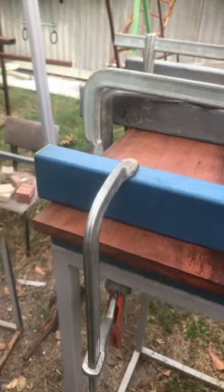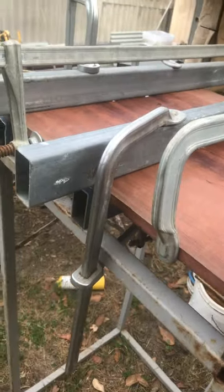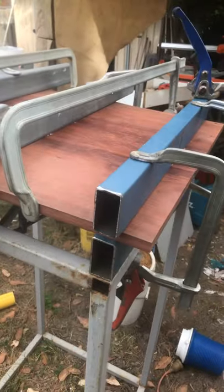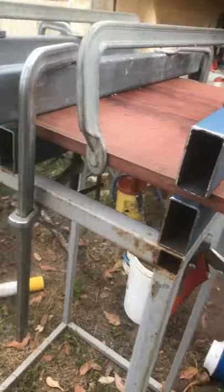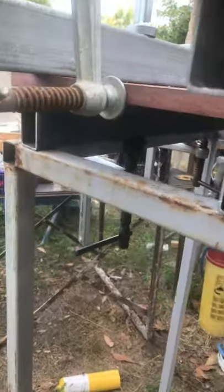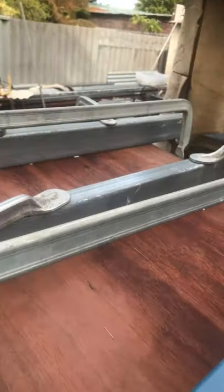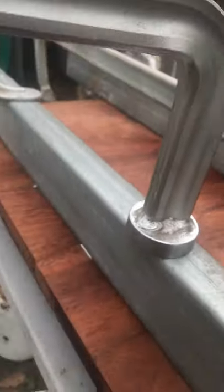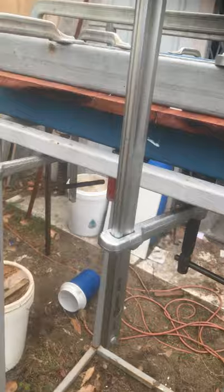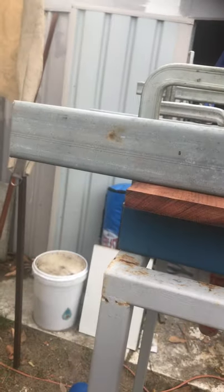Welcome to Ron's show. In this next piece I'm making a board for the bottom of a drawer runner. I've clamped all these together and wiped it down. I made them 10mm longer so I can cut it all square. I've done a few of these and had some failures - this one was a little bit out and twisted, but I'm getting it right now.